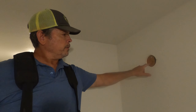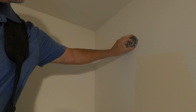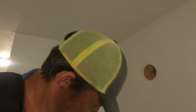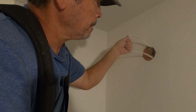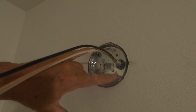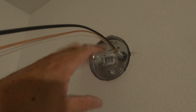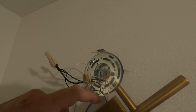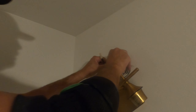There's the wire we put in during rough-in. On this one, our connector is hitting the stud so the box won't sit tight. We're just going to remove that little part with our oscillating saw and then we'll be fine. Now let's fish the wire out — I used a piece of ground wire from my 12-2. Let's mount these boxes and get ready to put up our lights. I had to put the box at a 45 to accommodate the knockout where we made our notch. Let me go get a ground screw and we'll mount this light.